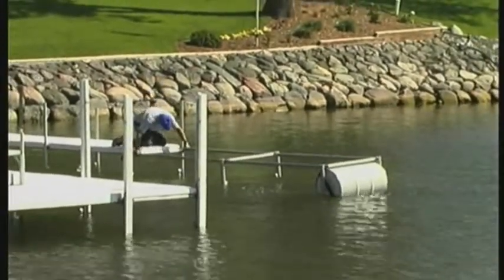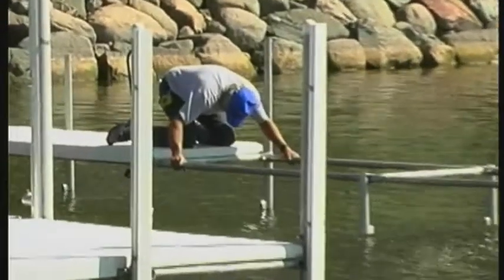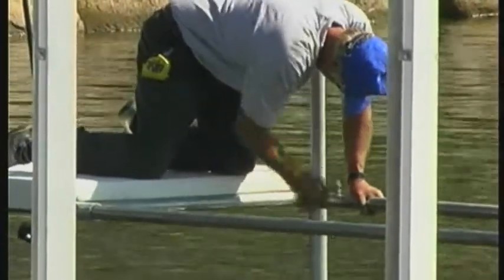After the frame is floated out, he will pull the frame pipes into the continuous bracket so that they are tight against the previous frame pipes. Then he will tighten the set screws. Install the two decks, four vertical pipes, pound in, level, and tighten.